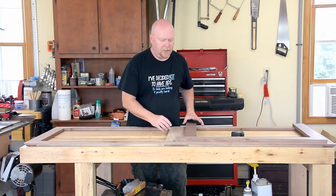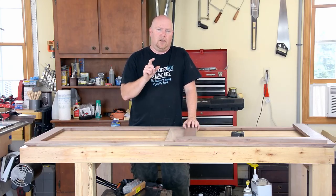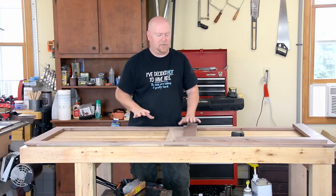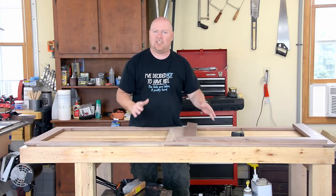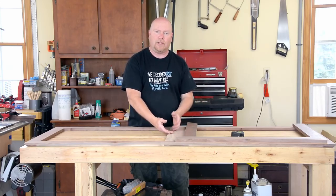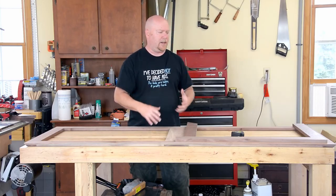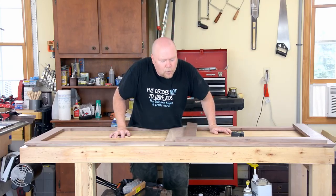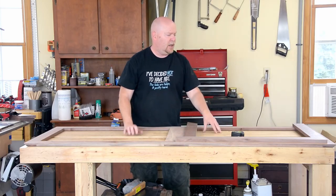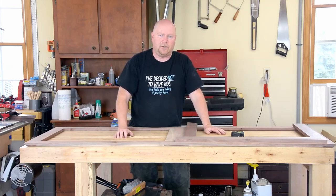Part of the joy of building things yourself is that you can make them what you want. For instance, the plans I drew up for this thing called for a one inch reveal around the outside of the front door frame — it's just not big enough. Now that I've got the stock laying here, that's going to all but completely cover up the cathedral grain in the center divider and just make the doors look way too big. So we're going to go inch and a half, inch and three quarters — something like that — reveal on the outside, which is good because that means I need to make these pieces shorter, much easier than making them longer.